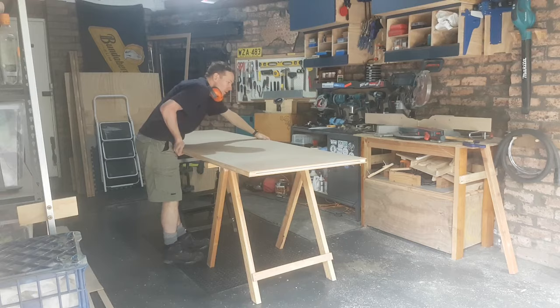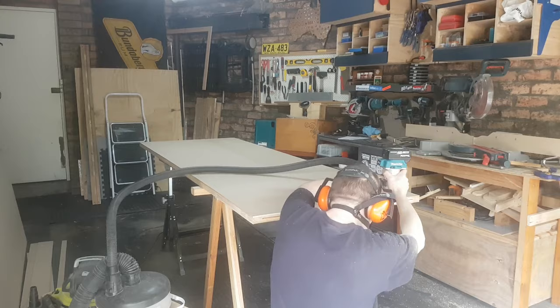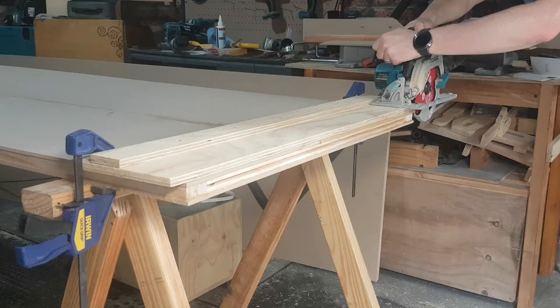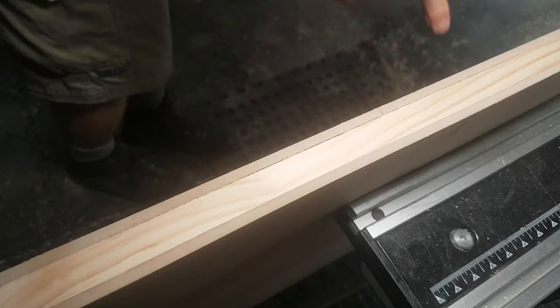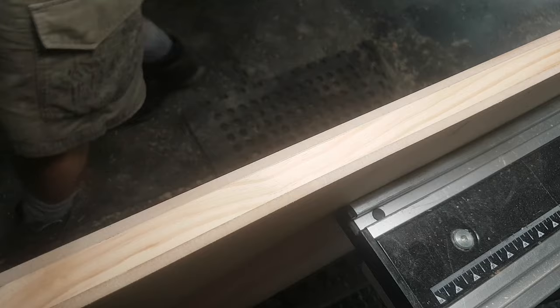I've been needing a sawhorse for ages and never made one until today — I really needed it for this next stage to get the doors up off the floor. Some bed slats and a few minutes later we had that sorted. Here we have the completed sandwiched doors with two sheets of MDF over the frames. My first thought was to use the flush trim bit on the router and then the planer followed by the sander, and that worked to flush everything up. But on the second door I realized I could use a circular saw and a straight edge to get the same effect much, much faster. I had a few gaps where clamps were missing, but with some glue and the orbital sander — all gone.